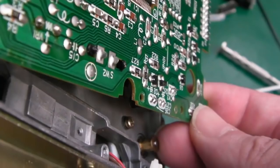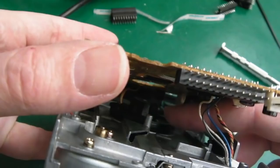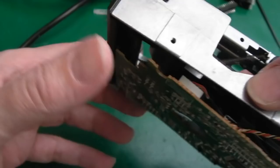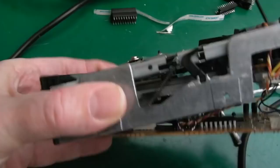So the other place we need to do this is this main black wheel in here. Can you see this? This is quite fiddly to get to unless you disconnect the wires. I'll show you, you could disconnect this here and then just pull it out. That would give you a bit of freedom with the drive. And there's also, can you see an orange and a yellow wire down there? Those are attached to the little PCB below. But if you unscrew those things, it could be a bit fiddly to get it back on. And from my experience, you don't tend to need to.